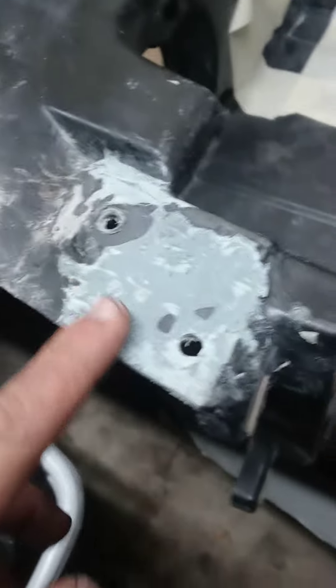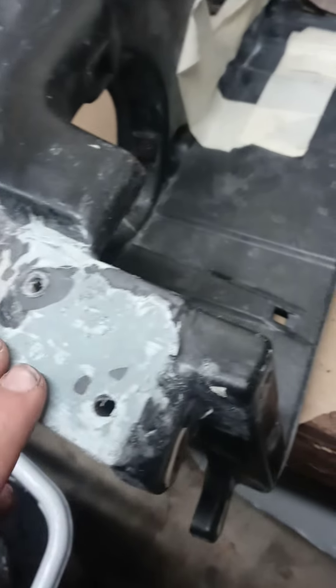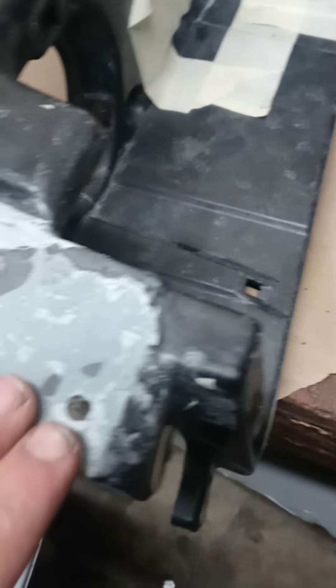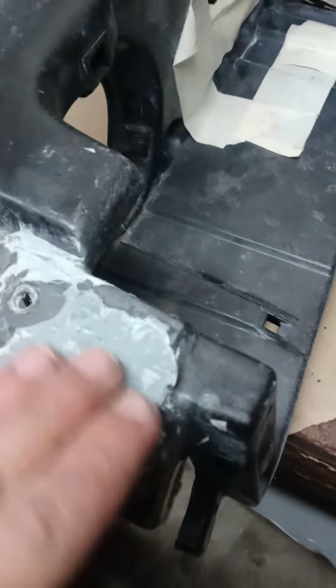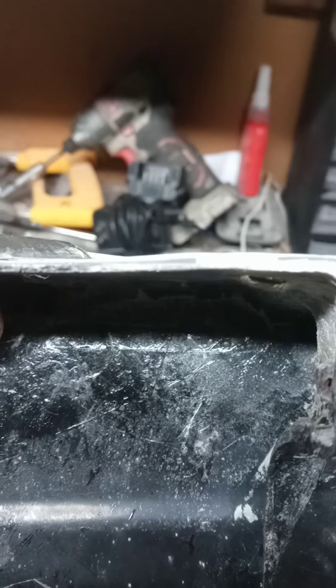It was really thick, so I used a dremel that I bought from Walmart a long time ago and just shaped it with the dremel and sanded it down quicker. I used it on this part right here and also on this part. I did 150 grit, then I used 220 sandpaper and made this part smooth right here. I need to finish touching it up.